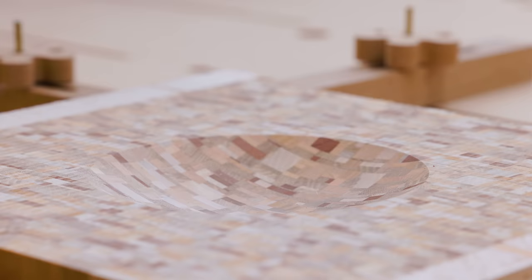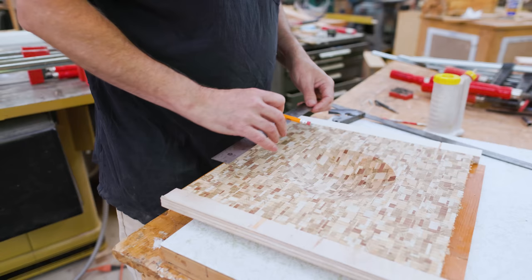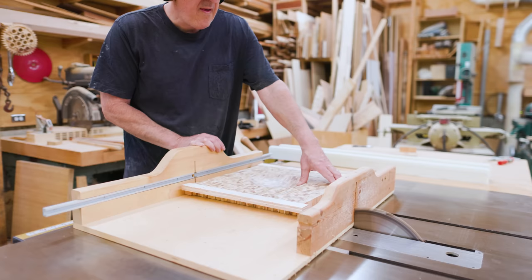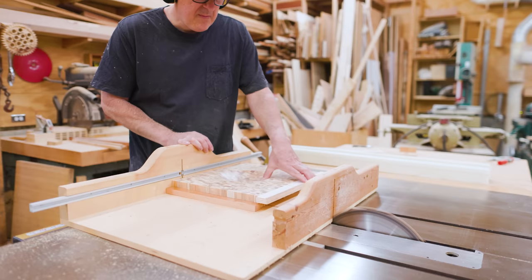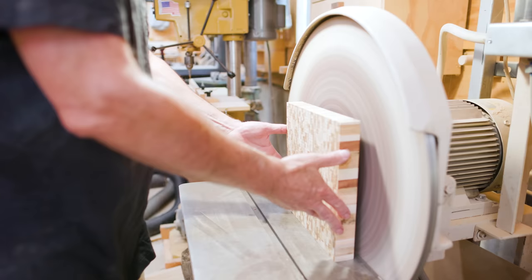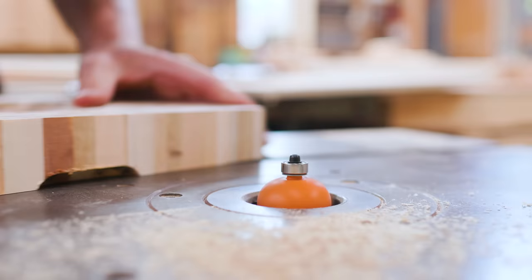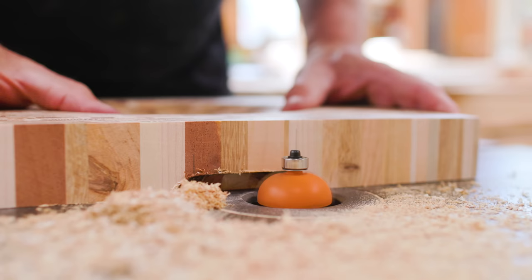And the knife seems to work — it was surprisingly easy and I didn't really have any problems. Then I wanted to cut off the excess, as this is bigger than I planned it to be. Before I did that I sanded out the hole. I'm going to save the pieces I'm cutting off — maybe I'll find something else to make with them, as the pattern is pretty cool, and I can glue those scrap pieces back together and the pattern should be continuous. And I can sand the flat part of the cutting board with the disc sander. I wanted to add handles on two sides, and I lowered the bit and took a few passes to cut these, as it was taking off quite a bit at a time. The piece isn't real big, so it was a little bit of a challenge holding it.